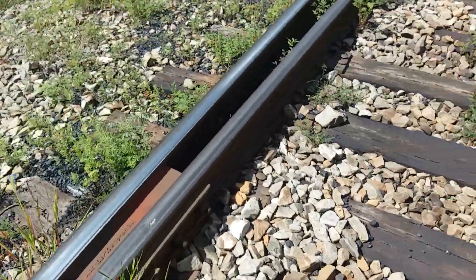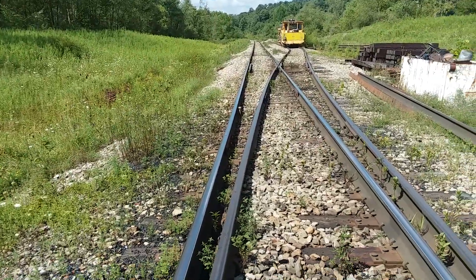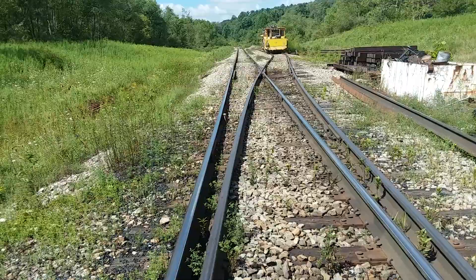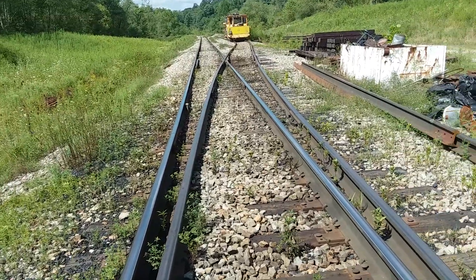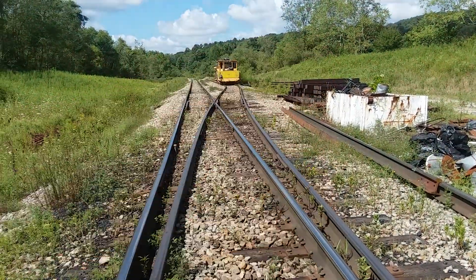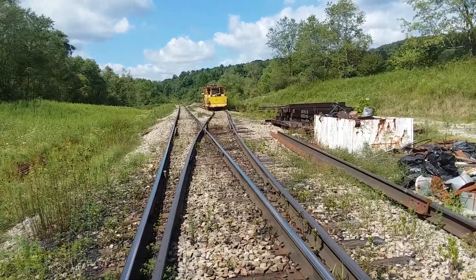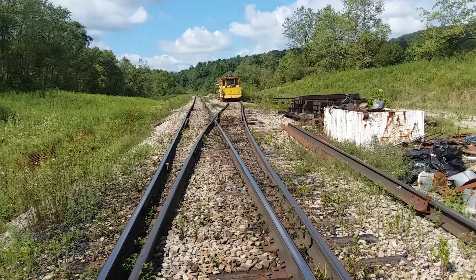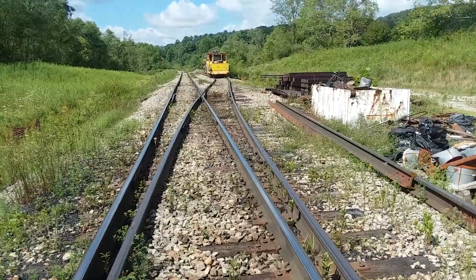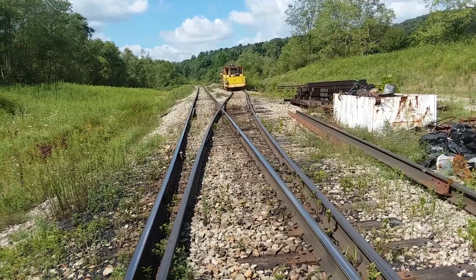Here's the rest of the parts of the turnout, from down there at the end of the switch up to the end of the turnout. The main line is called the parent rail. Once it gets past through the turnout, it reverts back to main. The rail into the siding — we have a siding — could be a rail into a spur. A spur is different from a siding, where a spur would go into an industrial complex. This side over here is called the turnout track, also called the diverging track through the turnout.